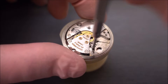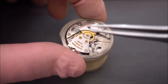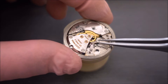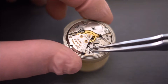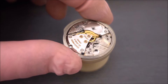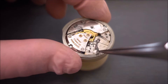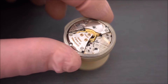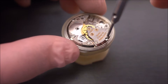That's the first screw and then the second screw. When I undo the screws I'm fairly gentle, taking them up to a point where I can pick up the threaded part with the tweezers. There are two reasons for that: firstly I don't want to scratch the top of the head, and secondly it's pretty hard for the screw to vanish if you pick it up that way. Now I'm just picking up the pallet fork and I'm going to take off the train bridge next.